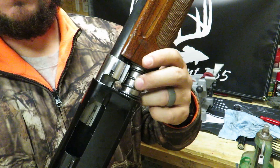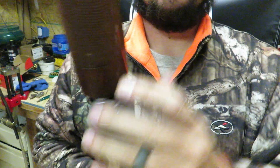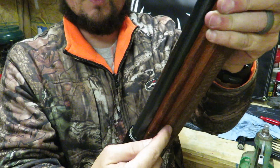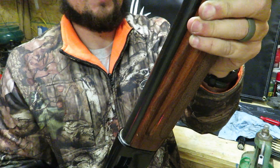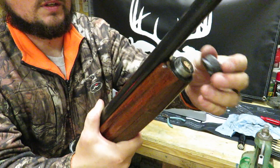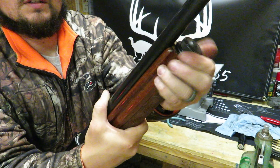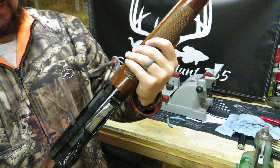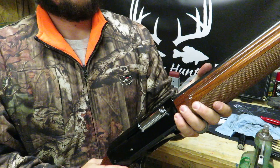When you're pulling this down, just like with your bolt, these grooves go into the same grooves that are inside the gun on either side — so when you push this down make sure they line up inside those grooves. The reason I put the forearm and the barrel together first is because there's actually a lot of tension now with that spring underneath the forearm. Grab the cap, don't cross-thread these things, and send that home — she works just like she's supposed to.